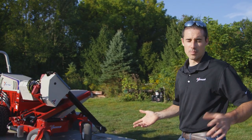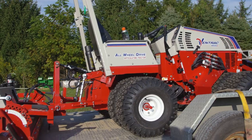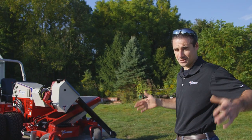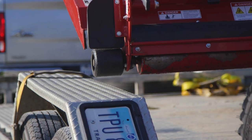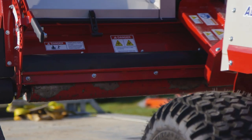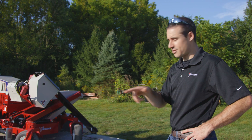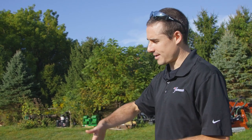So if we're doing the wide area mower then why is the boom mower on the tractor? Well we also want to bring a boom mower to use, but we had to put the wide area mower on the back of our tractor on the three-point hitch to get it over the wheel wells on this trailer. That's one of the first questions people ask when they do see this thing — because it's so big — is how do I trailer it? So if you want the deck on the front of the trailer you're gonna have to put it on the three-point and raise it above the wheel wells. If it's on the front of the tractor you can load it up on the back of the trailer — you can either have it sitting on the overhang or you can flip the deck up itself and just have it in transport mode vertical, and it'll only occupy a foot or so of the trailer. So there are some options, but this is one way to do it.